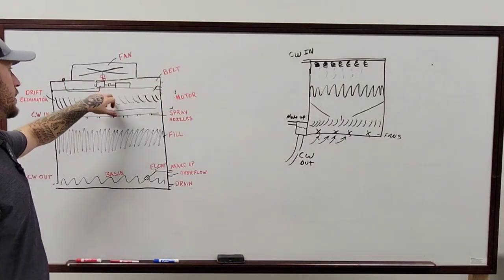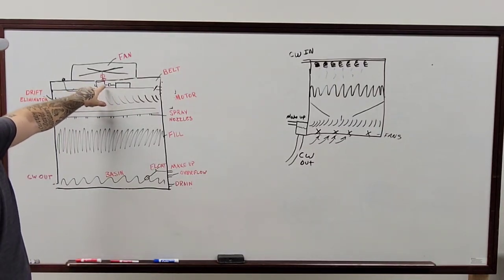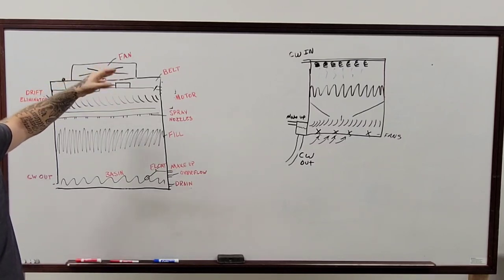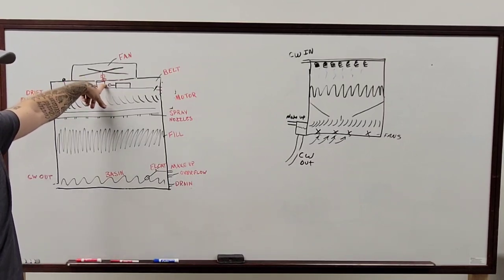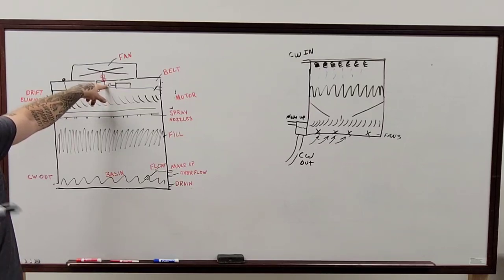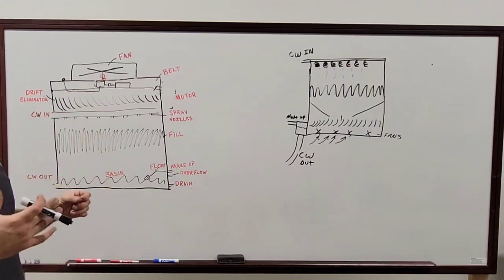This is also where I'm talking about that pinion ring, by the way, the pinion seal. Right where the shaft goes into that gearbox, that's where your main oil leak always comes from, most of the time. So you have the pinion one around the seal of the shaft, and I can't remember what the outer seal one is that goes around the bearing that's inside of there. There's usually 4 bolts going into there. There's another seal right there, so you'll have to determine which one's leaking.